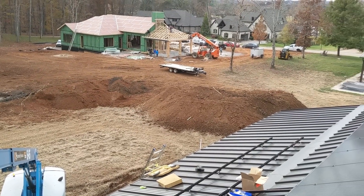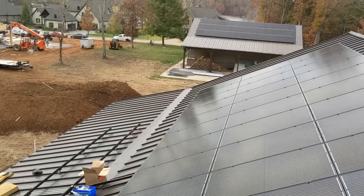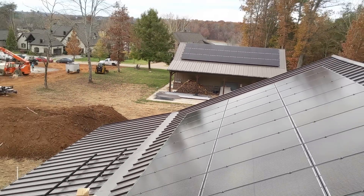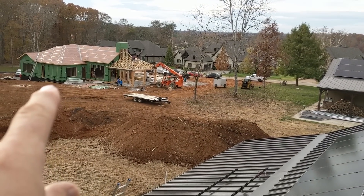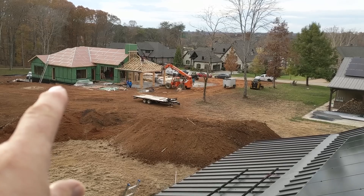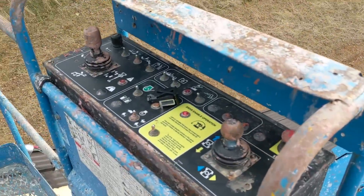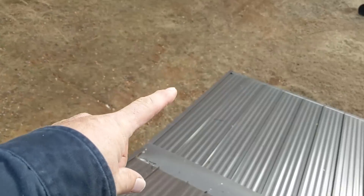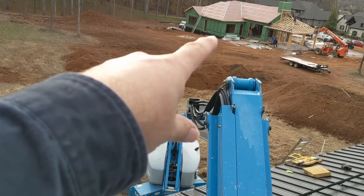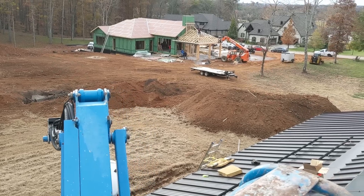It's a race against the rain. This is phase one — we've never done a job like this, but it's been fun. Phase one is to get all the solar mounted down to disconnects, everything landed, voltage checked, and then we trench from here. Just below grade we have two three-inch conduits going through into the mech room — one coming through the front, one up the back side. We have our weather head coming down to a gutter on the outside, then we trench right into the mech room. Two two-inch runs, bringing 28.5kW into the house.